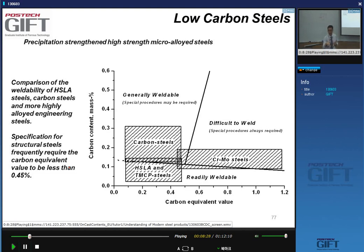Why is welding and martensite so related? Because when you weld, you heat up the material very quickly and you cool it down quickly also, right? And so there's a big chance, and many welds are martensitic, yes? So they'll be hard, and they may be hard and brittle if they contain lots of carbon, right? And if they're hard and brittle, and they're cooled from the liquid phase very quickly to the lower temperatures, you may end up having cracks, yes? And what we call in general welding problems, yeah?